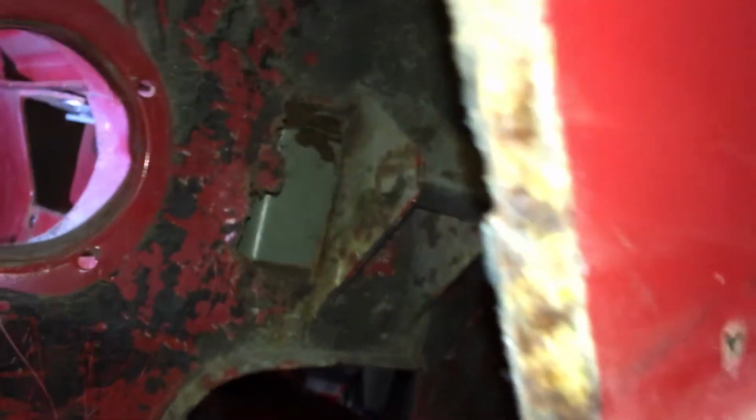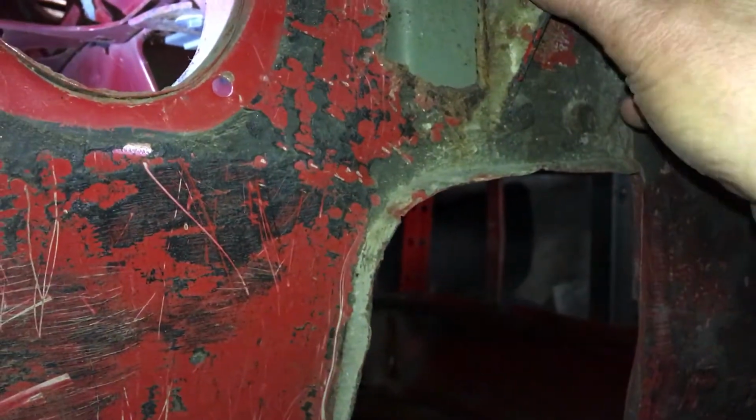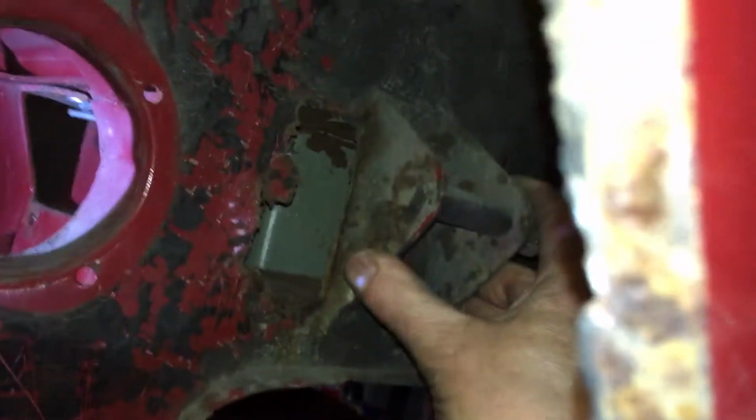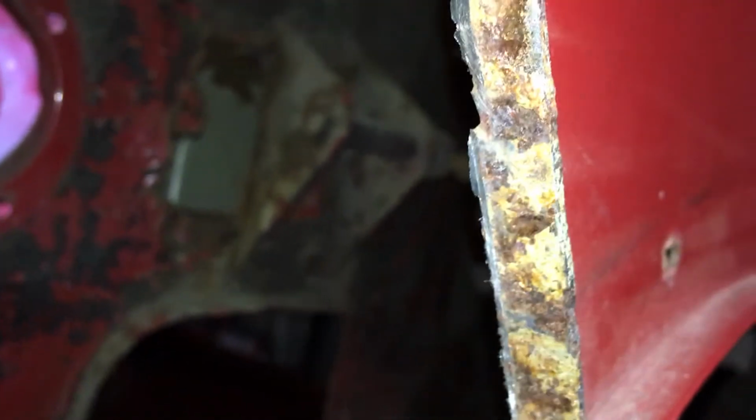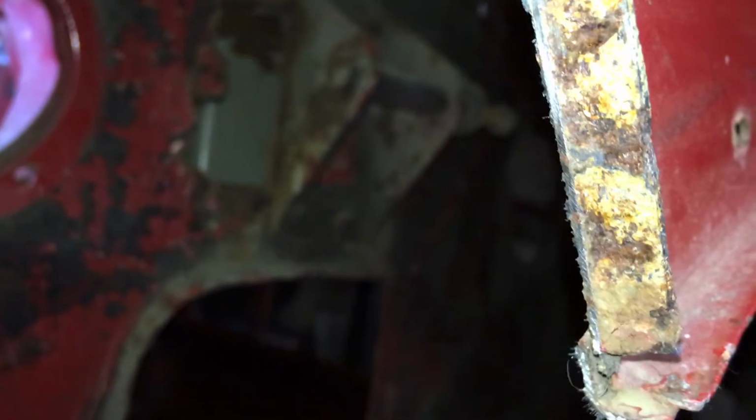until when we got it in this position, and I looked under the wing, and there we have a nice hole which is right next to the jacking point. And I know that these jacking points are notorious that when you take them off there's a hole behind because it's like double or triple skinned. So I'm thinking that quite possibly once I take this jacking point off there's going to be a hole behind there, or a weakness if it's not all the way through. So I think I've come to the conclusion that I will change the inner wing.